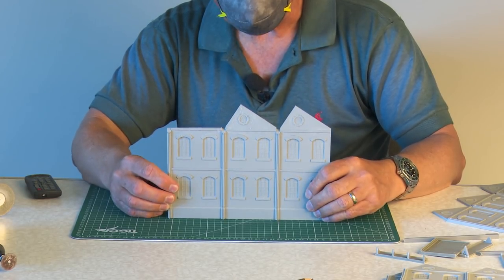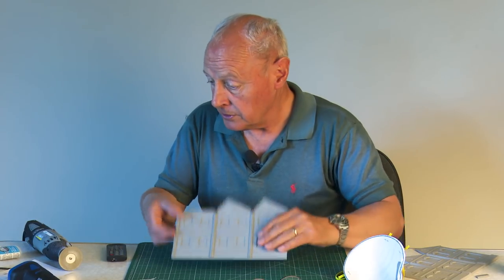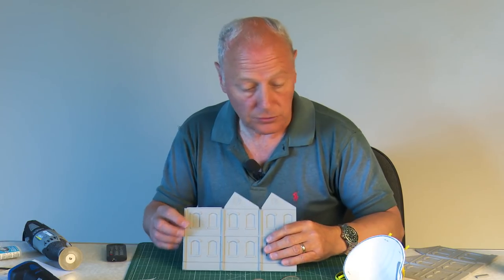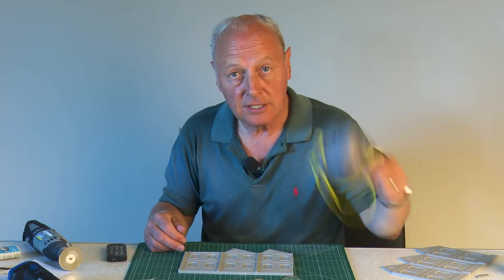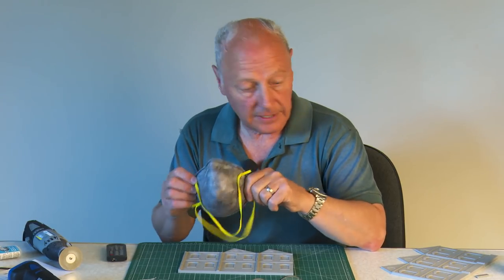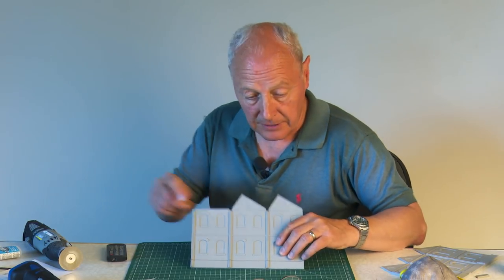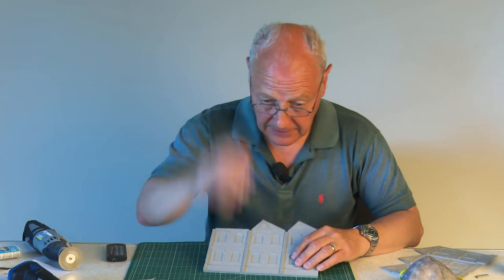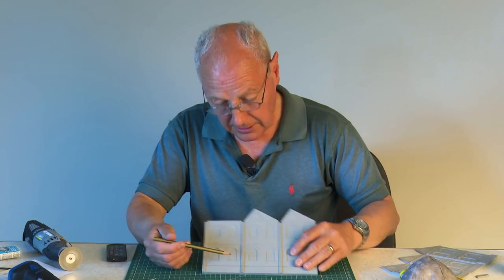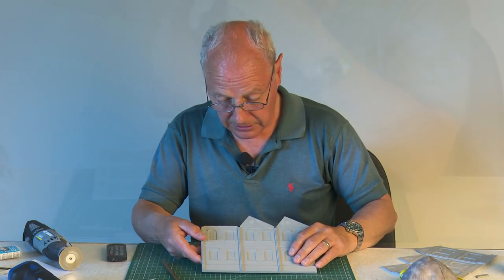And there we go, piece of cake that is. Yeah, just a word of warning there. When you use the disc cutter on these, which makes a brilliant cut straight through, no problem at all, it does generate a great deal of dust. So either do it outside, with a wind behind you kind of thing, or a little face mask is exactly what you need. That piece came off very, very easily. And now all I'm gonna do is run the disc cutter again straight down here. Straight down that line there, and then we can crack on.